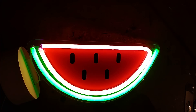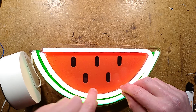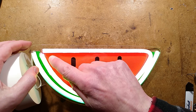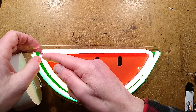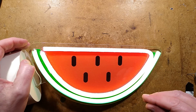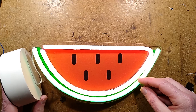Watch your eyes — the light is coming back. The neon ornament is now repaired, and it was done in-line as opposed to just connecting to the other end, which it turns out would have been fairly easy. They didn't slide the LED tape out to terminate it — you can see the slit on the other side where they slit it, peeled it back, and soldered it on. But there we have it. It's a repair, it's a good one. The job is done.